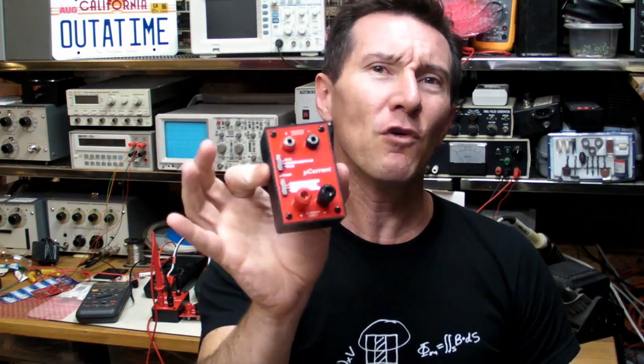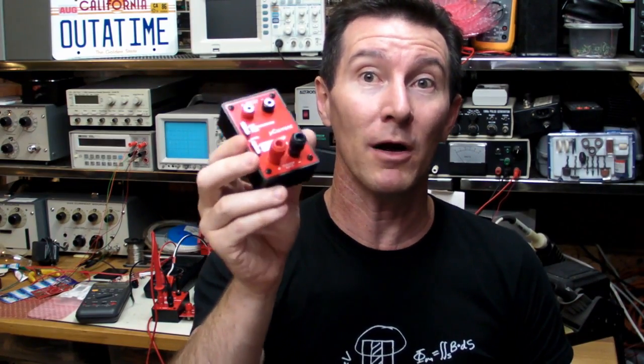Those resistors are usually very, very reliable. You either get the right part and it's spot on within spec — 0.1% — or it's the wrong part. I don't fully test every parameter before I send it out. I just do a spot check on each current range to make sure it's working, check the first build, and then ship them out. But after I shipped the second lot, I started testing and it looked a bit funny — the readings on the microamp range were slightly off.